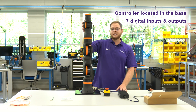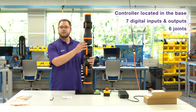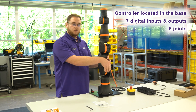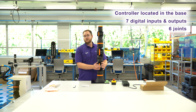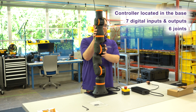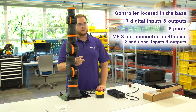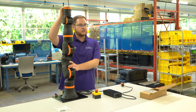Every orange ring on this robot is a joint. This is the six degree of freedom — six DoF version — six orange rings, six joints. We also have a four and a five DoF version. The motor and motor controller sit in this compact joint space — not only the gear, but also the motor, motor controller, and brake, so the whole joint can function on its own and is available as a standalone version. Additionally, on the fourth axis there is an M8 8-pin connector with two additional inputs and two outputs, plus ground and 24 volts to supply the tool you put on the TCP, the tool center point.